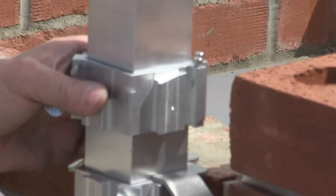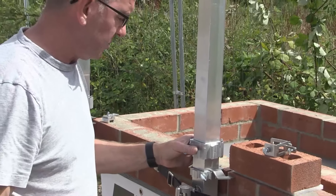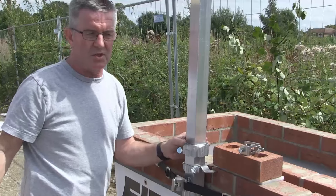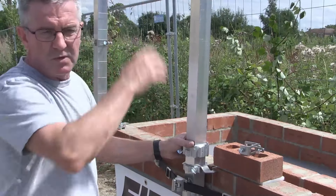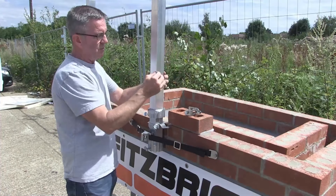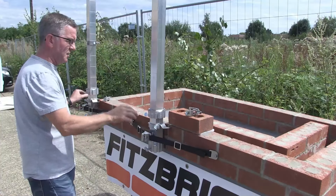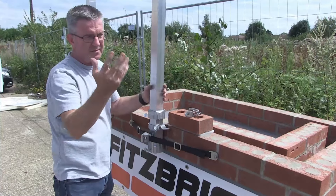I always do that — we always done it on price work. We built corners first and broke our runs. So you'd have an external, an intermediate, and an intermediate, 13 courses out or to suit your windows or door jamb reveals. We'd build the corners up and off we go. You would laser around or find your gauge, your datum, laser it around and adjust these to it. What you've done is you've got a line running and all your gauges leveled — done, very quick.